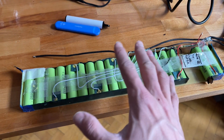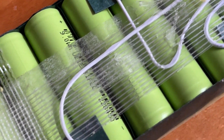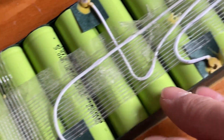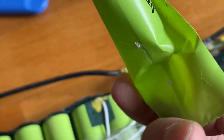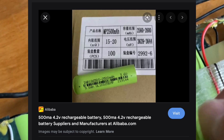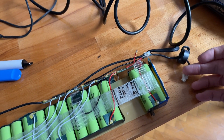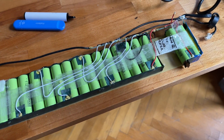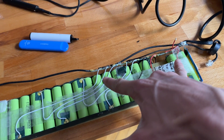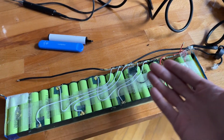These cells use some kind of yellow wrap — I can't quite read them. I don't know what brand these are; I think they might be fake. Even if they are some known brand, I think they could be counterfeit. The pack would not take a charge through the charging cable, and would not charge through the discharge port either, appearing completely dead. I measured about 38 to 40 volts across the pack, so there was some voltage.